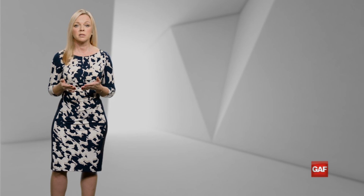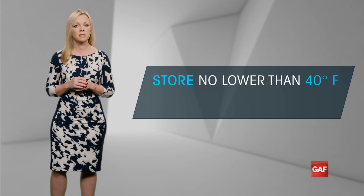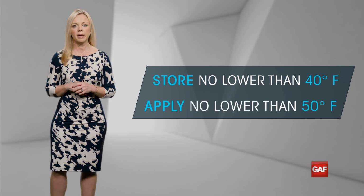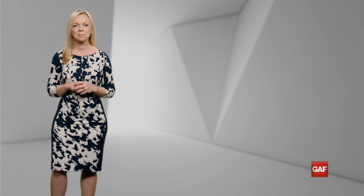RoofMate is water-based, so store it in an area that is at least 40 degrees Fahrenheit to make sure it doesn't freeze. And make sure to apply it at 50 degrees Fahrenheit and rising. Neither should be a problem in the San Diego area, but it's important to know.